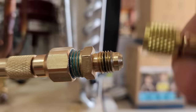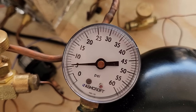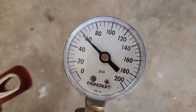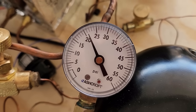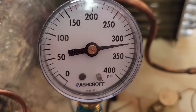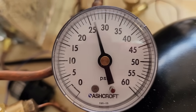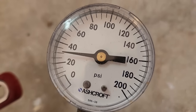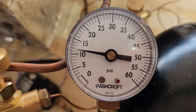Once I had confirmation that everything was working, I pulled out the ethylene storage tank and hooked it up to my second stage fill port. The initial charge used about half my collected ethylene, meaning it consumed about 42L STP — that seemed a little surprising, but I guess the intercooler added a lot of volume to the system. The initial charge got me 320 psi on the high side running 25 psi on the low side. No real cooling was occurring yet though, so I drained my tank down to 30 psi from the original 120, bringing the high side to 350 psi with the low side around 12. Still nothing was really happening.